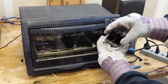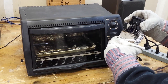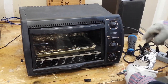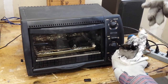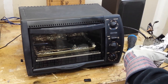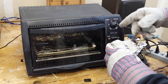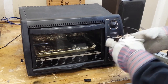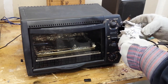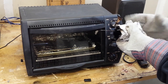You see the mess in there. There's a lot of capacitors inside this thing. And this tar — check that out, guys — they're all lifting out because I got the tar good and hot. There's all the caps. I don't have to worry about scorching the wires now. Here's the ground wire. There's a little divider. I still want to clean this thing out. Here's the remains of one of the caps — it started to unroll itself. I'm going to heat this up. This should happen a lot faster now. I didn't realize they were going to slip right out of there like that. I typically just drain the stuff out and it comes out pretty clean.